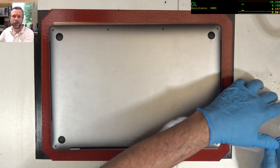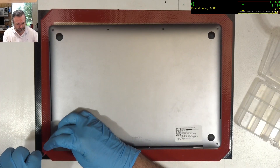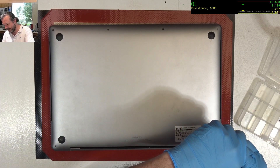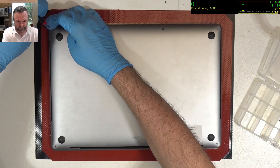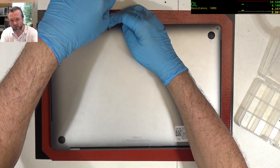First trick with 2141s and 1990s is to not power them up. Just don't power them up. It doesn't matter if you just want to check — just don't power them up. If someone else has powered it up, nothing you can do about that, but don't add yourself to that list. Sometimes the difference between getting data back and losing it is that one more power cycle.